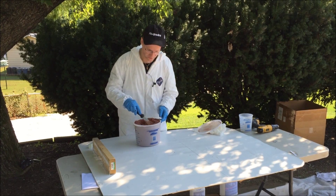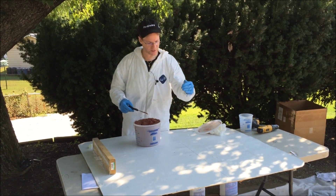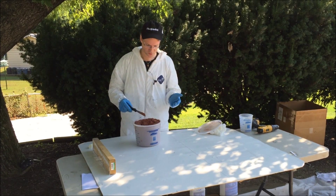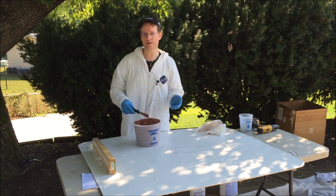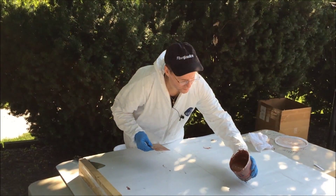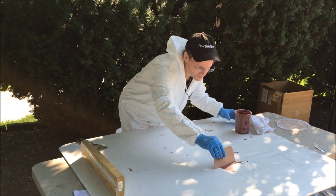The purpose of it is to mix it with epoxy resin to thicken it up enough and make it sandable. Because epoxy resin is so hard to sand and it won't stand up — it's not good for making fillets. But if you mix in Phenolic Micro Balloons with your epoxy resin, you can use it for filleting just like you would Bondo on a car body.